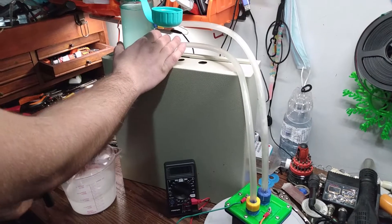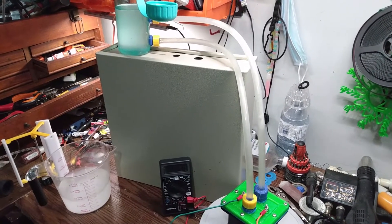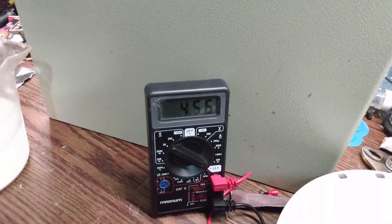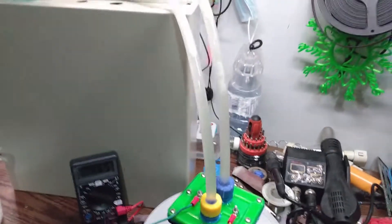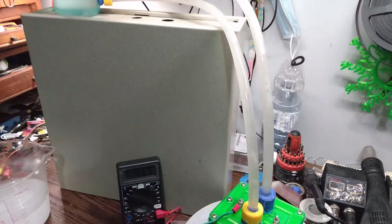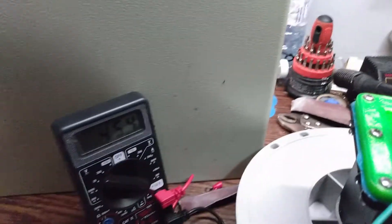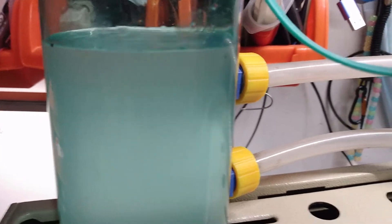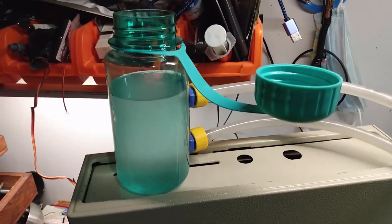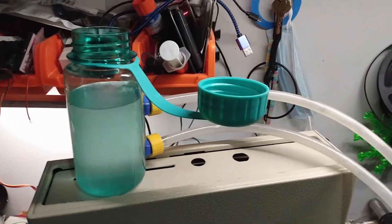A little bit higher than that — the power supply is hardly happy. I'll have to dilute that a little bit; too much electrolyte. I've got a few leaks, but as you can see we're at four and a half amps. I'm surprised this power supply is still working, and you can see the gas coming out — that is hydrogen and oxygen. So we're a success! Now I need to work on a better tank, some sort of bubbler as a flashback arrestor, and then a torch. But it looks like it's going to work.